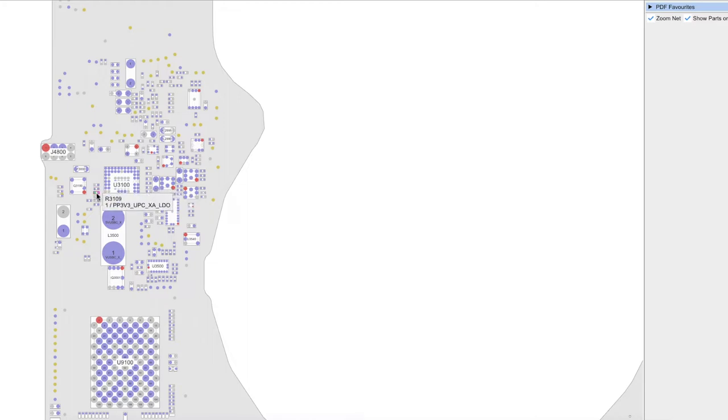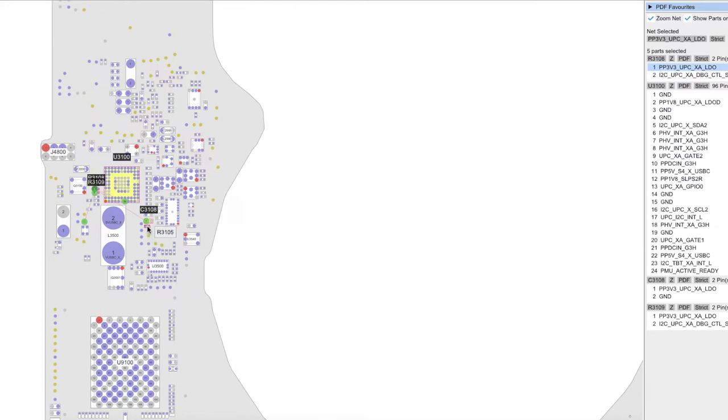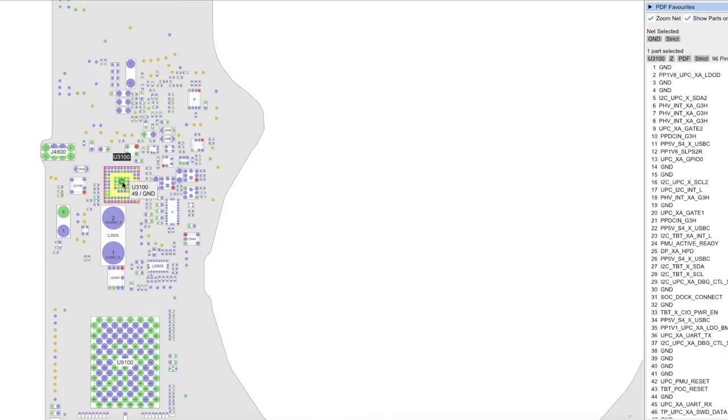I put a new resistor, connected those two together. Then I jumped a wire — because it was a broken trace — jumped a wire here to this capacitor, as I will show you in a second. Then the signal came back, the power came back. I was able to power up this chip, which in turn gave 20 volts.